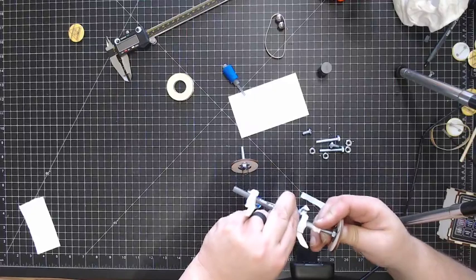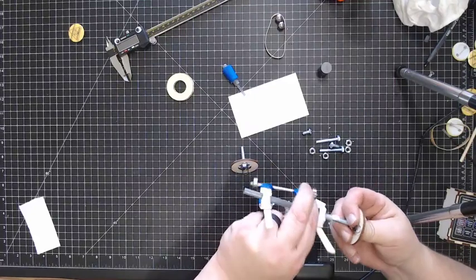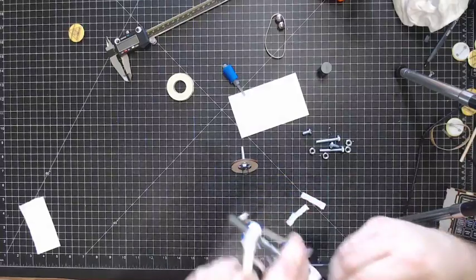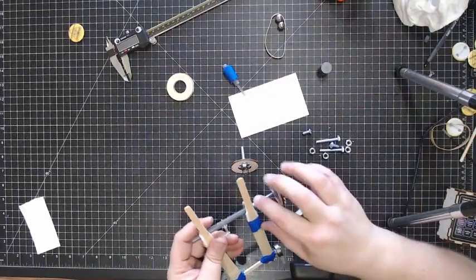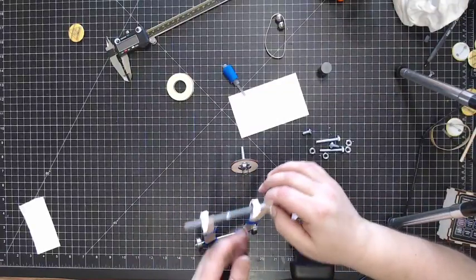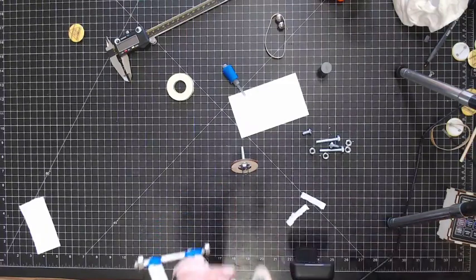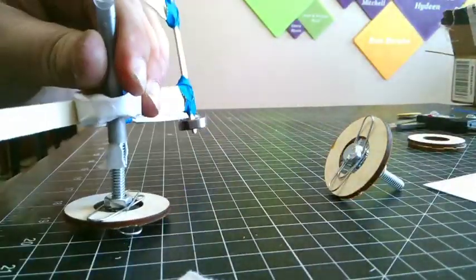And what I've discovered is that it's very hard to do because now those 4 pieces of paper don't want to go in. And that means that we've done it right. What we've done is we've used that paper to create some tension so that now this piece here is the right size, and now this won't just slide in or out anymore.